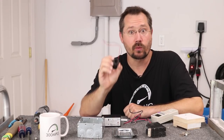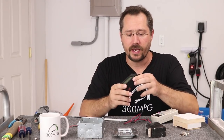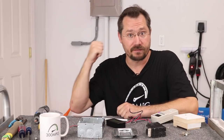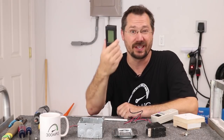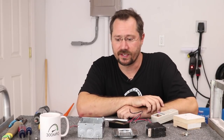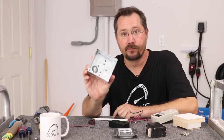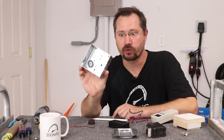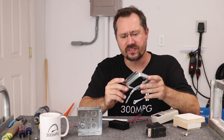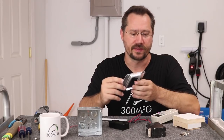So I'll have to get this coil around one of the wires for the solar system, hook it up to the meter, and run two wires for power. That means I'm going to have to get into the breaker box. I also need something to mount this into — I want it clean and to code. So I'm going to use a four-inch plain electric box with a single gang cover.